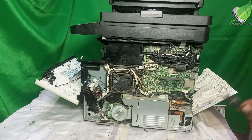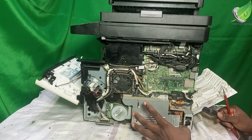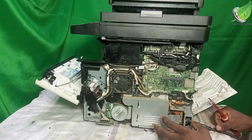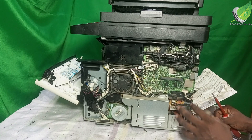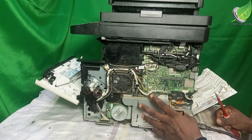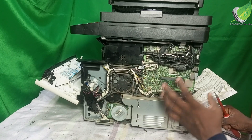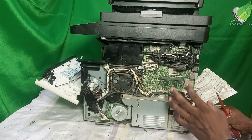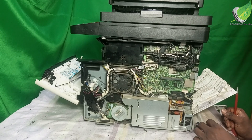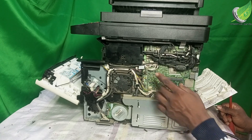This is how it works: when you plug your power plug into the printer, the power supply unit is supposed to send power within three to five seconds to certain components on this printer. So if the connection here is loose, it won't be able to send power to all those components and it's going to come up with error C6400, which is the zero crossing signal problem.